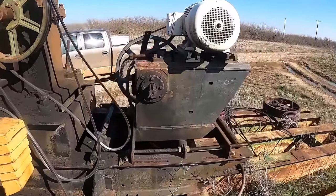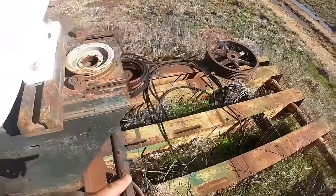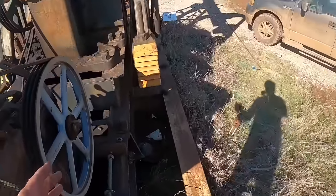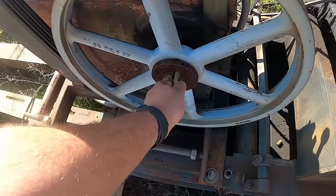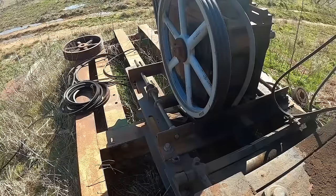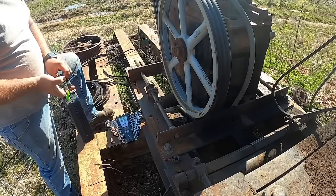We're going to have to take this thing apart, take this to the machine shop, either turn this down or weld it up and turn it down or something. This actually has already kind of happened on the other side. This sheave used to be over here, and it was a pressed fit. It didn't have a hub or anything in it. And it started moving, but I caught it before it wore anything out. And I put one with a QD style hub on it and drove a bolt in it. I did some Harbor Freighting. Tools are kind of disposable out here.